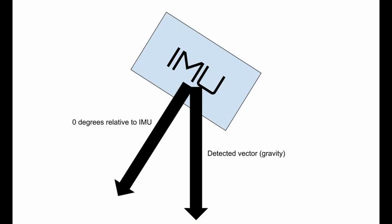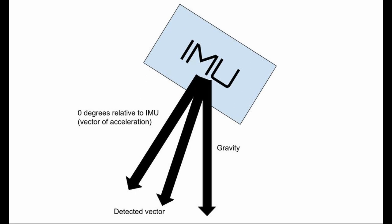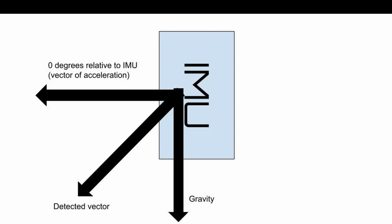Once we get the data, we then have to figure out what orientation the rocket's in. This is actually a much harder problem than you might think. The IMU normally knows what orientation it's in by detecting which way the acceleration of gravity is pulling towards. If it's accelerating though, which it will be, it'll measure acceleration pulling in the direction between the direction of gravity and the rocket's direction of acceleration, because it'll also measure that. This means that even if the rocket is oriented all the way sideways, it'll just measure something between 0 and 90 degrees, depending on how much the rocket's accelerating. I think I've figured out an equation to solve this, so I'll just make another video about it later.